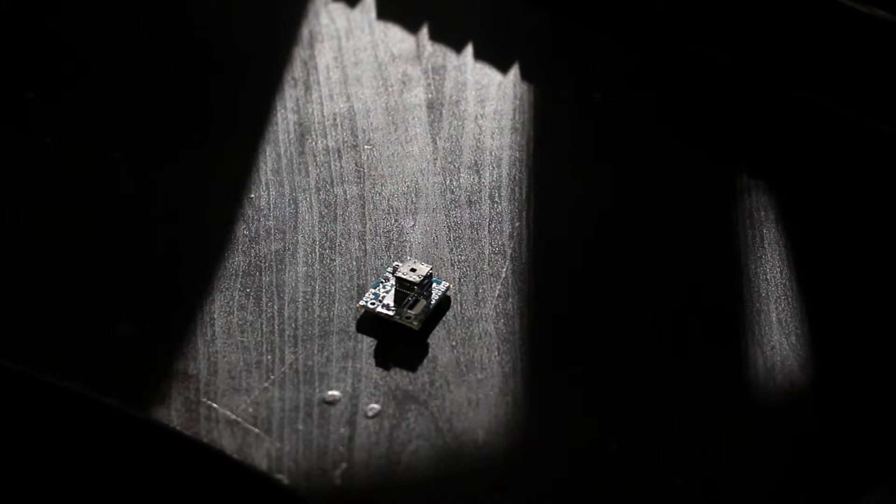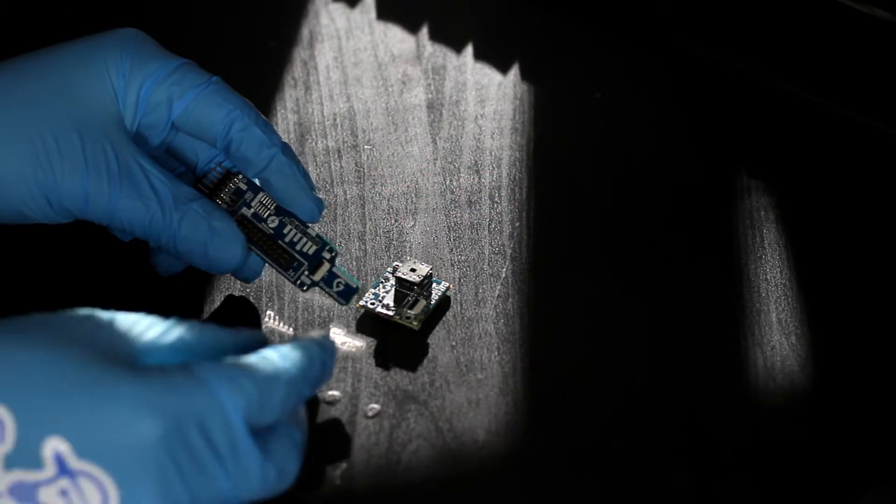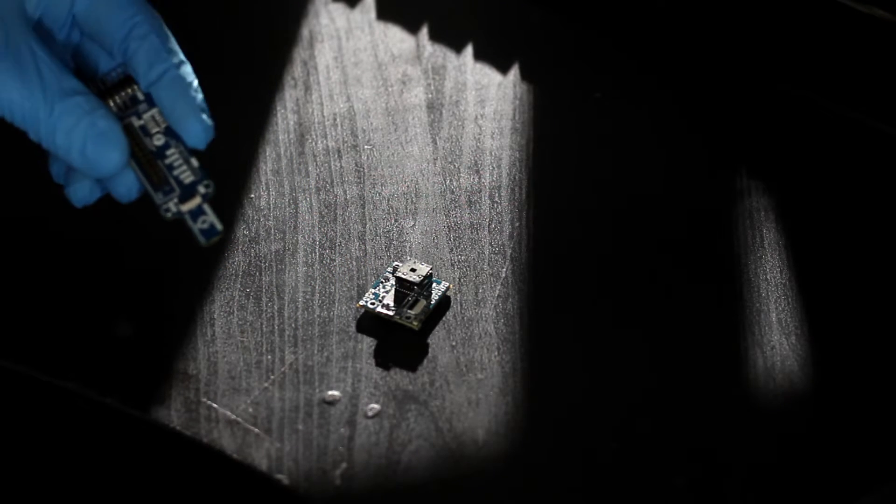Hello, this is a guide to help you flash the firmware onto a Pure Thermal One. You will need an ARM MCU JTAG adapter with ribbon cable, as well as a ST-Link version 2.